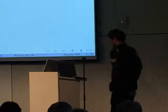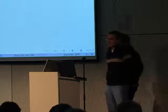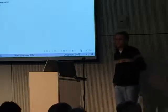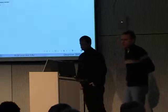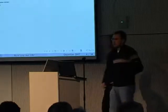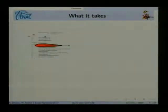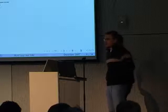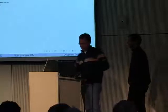So if you decide to build your own drone, what do you need? What are the main skills you need to start with the whole thing? The first thing people think about is the aircraft itself. It's an important thing, but you should not put too much effort into the aircraft itself. You should know why an aircraft flies, and you should get a good aircraft, but don't start with a small aircraft. Don't start with a fast aircraft. Take a big, slow-moving, big inertia aircraft that flies very well, and don't start with the small ones right away.